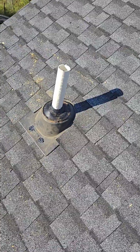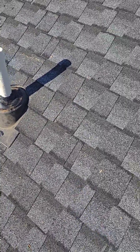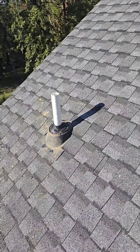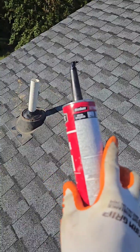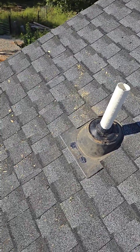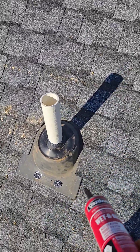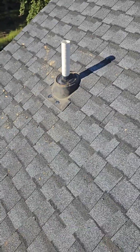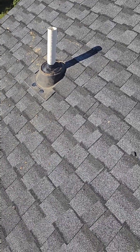Because of the new construction, the shingles are going to seal back down and it's a little warm, so I don't have to seal them down. But if for some reason you had to seal shingles back down after you've broken the seal, use a little bit of roof cement — a couple dabs will do the trick. What you're trying to do as a plumber is get these things in and then not get called back for a leak on them. And that is how it would be installed if a roofing crew did it and the roofing crew knew what they were doing.